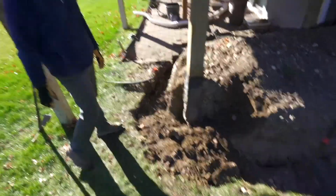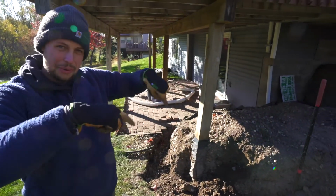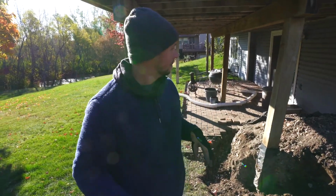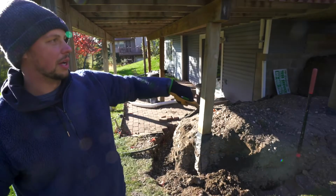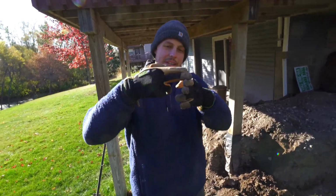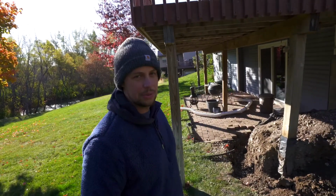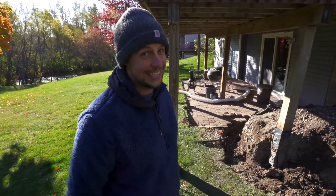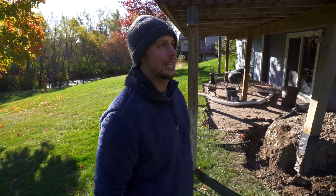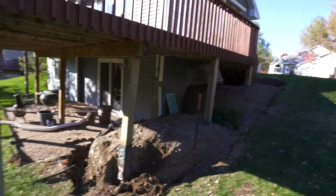So what we're doing is we're redesigning the wall. The old wall, it's all rounded, so there was really nothing holding it in and binding it together. So we're gonna put everything in, and we're gonna have 90-degree turns so we can actually tie everything together, kind of like this, have it overlap. We're doing new walls. We're fixing these posts the best we can. We've warned them we're not deck experts. They just said, please try anything you can. So that's what we're doing. Pretty straightforward. Just a wall and some deck posts.